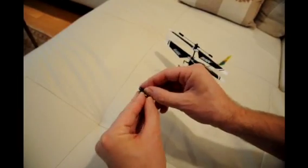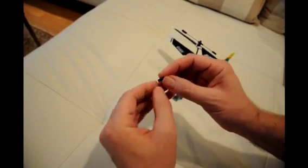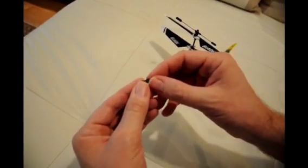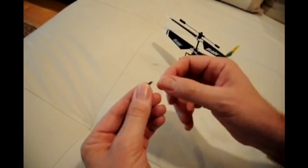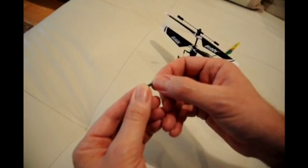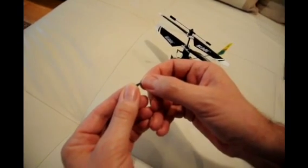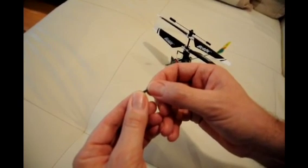This is the actual camera itself. This low-profile design is basically a circuit board with a board-to-board connector on one side, and on the other side a chip and our proprietary flat printed optics. This allows a wide field of view — theoretically up to 180 degrees, but in practice around 160 degrees. Using this information, the helicopter is able to control its yaw and its heave using purely visual information, without a gyro.